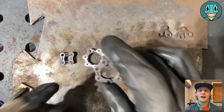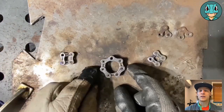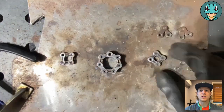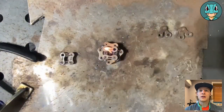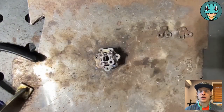With some quick magic, we're going to clean up all those welds and start with the head. Positioning these with the welded sides, the cleaned-up weld sides on the inside, those two seven-links are going to get some quick tacks. Then we add the four-link square on the top, and then one on the bottom as well to finish up the main shape of the head.